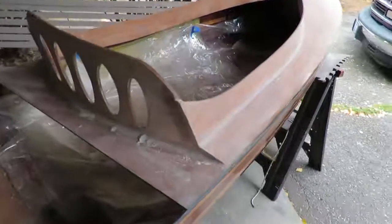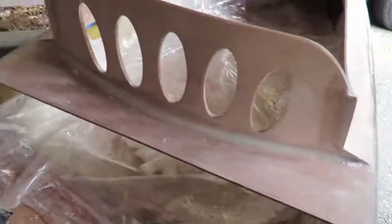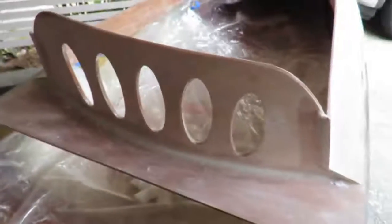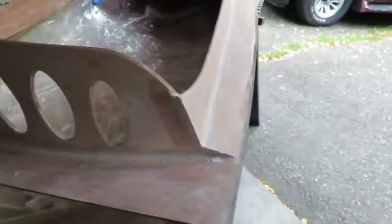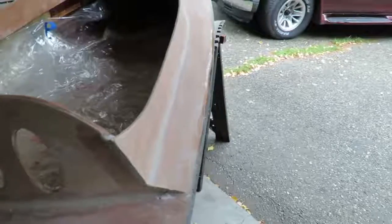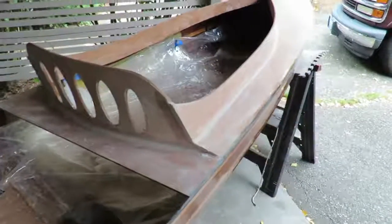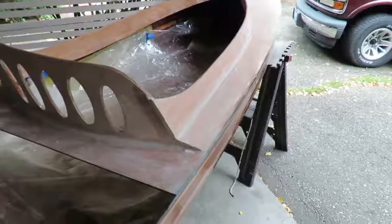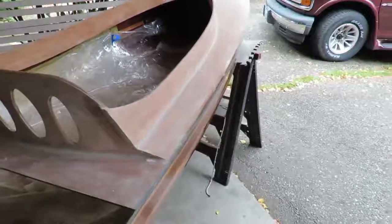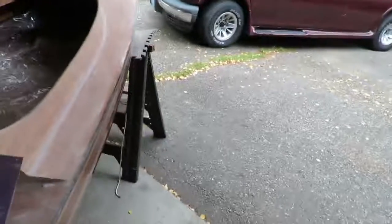Sanded our fillet a little bit more. I've been sanding on the back, sanding this back fillet here, and that's getting smoother. You can see quite a bit of sanding dust coming off. And do not use power sanding equipment on this because you'll sand through the veneer on the surface and get a discoloration if you get into power sanding. Also, you can't get into the various shapes.